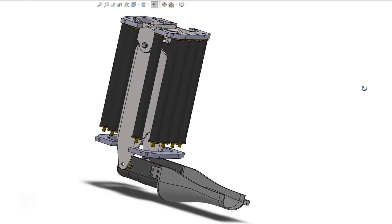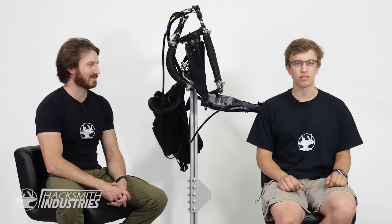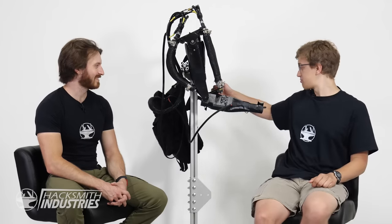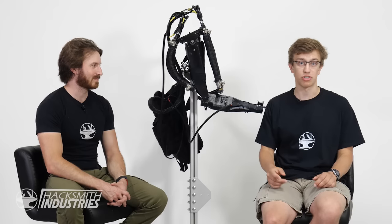One of the other problems that led to a loss of strength was that sometimes things just don't quite work out in the translation from computer-aided design to reality. You might have noticed in the drawings in CAD, there was 6 muscles across the front and across the back. And Bogdan and I both looked at the design for like an hour and looked it over very carefully and went, yeah, we can do this, this will all work fine. And then we actually built all the parts, cut everything, and we're going to assemble it and went, wait a minute, that muscle's inside of James. And so we had to just lop off two of the muscles because we couldn't make it work with those two installed the way they were, and because of the time crunch, we couldn't go back and redesign the parts. And so that led to us just losing 30% of the strength right off the hop.